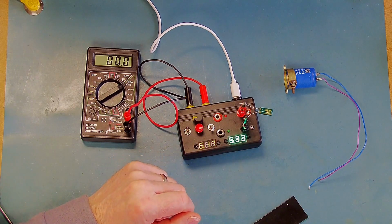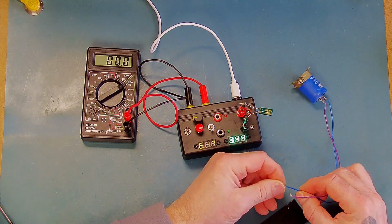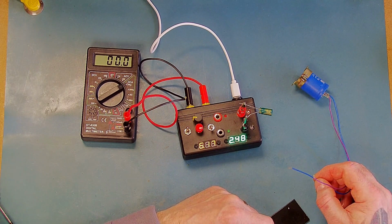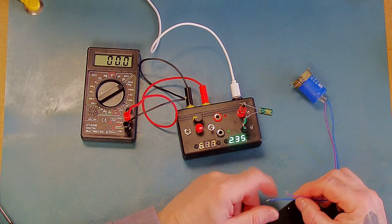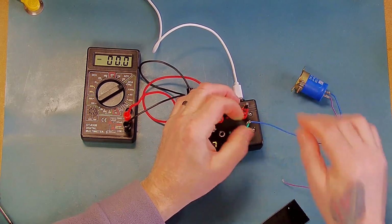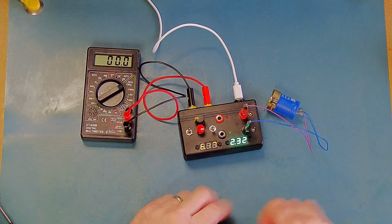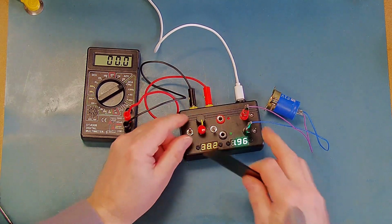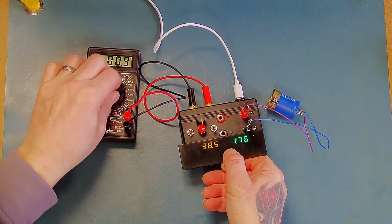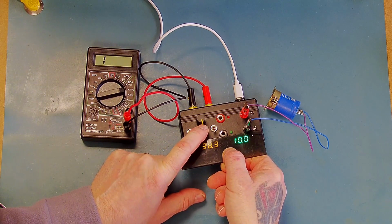And we'll just do a slightly larger capacitor. Let's go with this guy. Just let that discharge. See, the discharge LED is on. It's good enough. So I've got this old capacitor back in. We can actually go up to maximum voltage on that one. It's a 63 volt cap. Let's put this onto the 2000 microamp range. Current limiting resistors in, so it's still obviously going to go over.